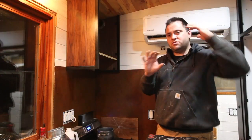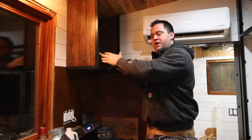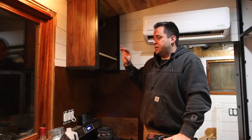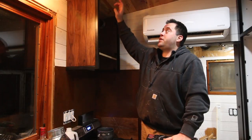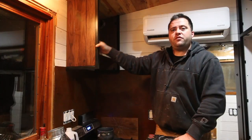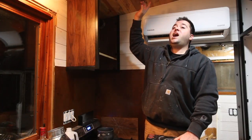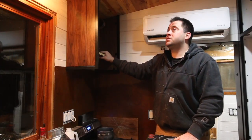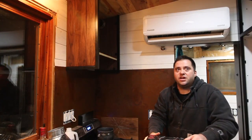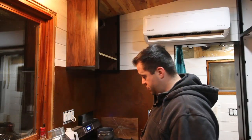Get out. So because steel is so difficult to work with, I kind of have to get to this point and then I can make this piece. I could do the math and figure it out, but the chances of me messing up, which I did on one of the pieces, it's better just to measure this now, cut that piece of metal, weld those tabs on. I'm going to do a piece of 2 inch up top here and I'm going to have to weld some angles on there at 7.16 degrees. When you're figuring your roof on your tiny house, remember that angle. Mine's 7.16. I've used that number on so many different projects, but it's important. It's 7.16 and then the opposite of that, 90 minus that, is the other number. That angle right there is the opposite of 7.16 degrees.